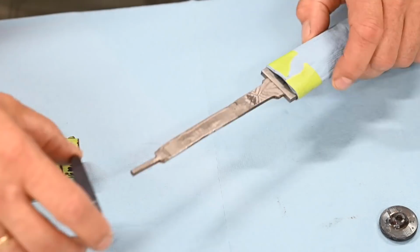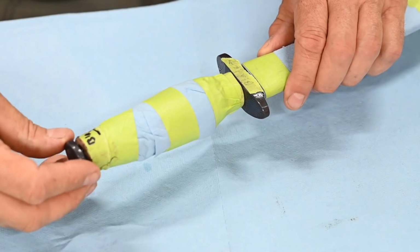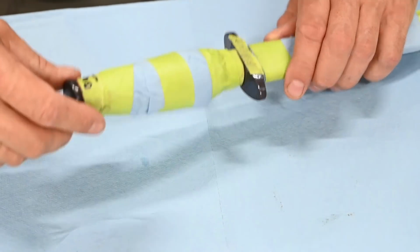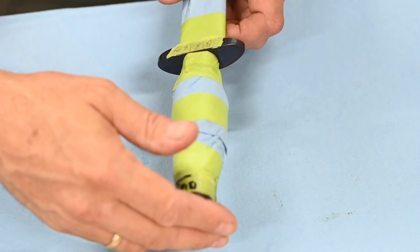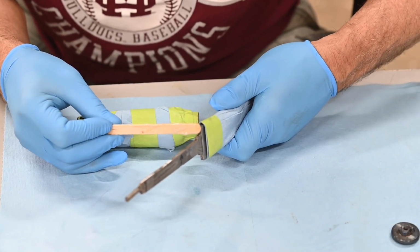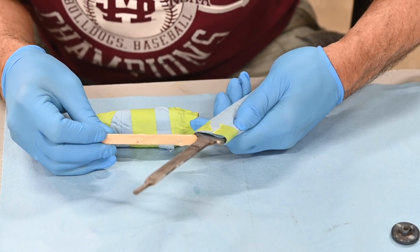Now we've got everything we need to assemble the blade. Key to assembling any knife, you gotta test that everything fits nice and tight, that everything lines up, and that you haven't messed up any of your clearances with glue, oxide, solder. There's nothing worse than starting to glue something together and finding halfway through that one of the parts won't fit through a hole or a thread's gotten gummed up or whatever. Fortunately, I've never done this myself, but I've heard of people who have.